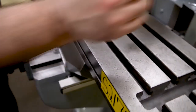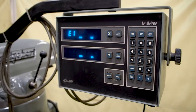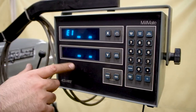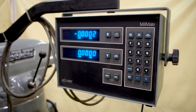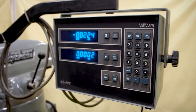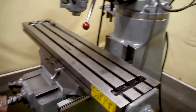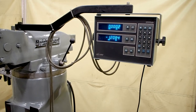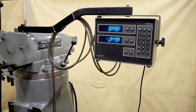This unit does come with a set of accurate digital readouts. Now when you first plug them in, you will see an E1 error — that means power failure. All you do is come over here to clear, and it brings you right back on. Then if you need to re-zero them you just hit the zero button. You can see both axes — here's the Y. They move really nicely; they don't jumble, skip, or anything. Very consistent.